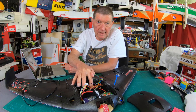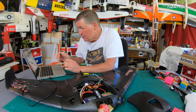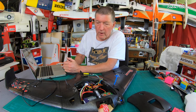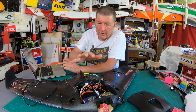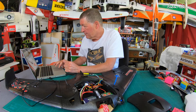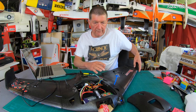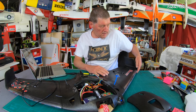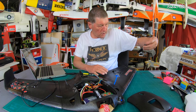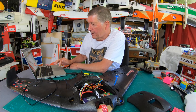You have to download the latest firmware from the Matek website because the configurator at the moment, version 2.5.1, won't give you the right firmware for the board. So you just flash it with the firmware from the Matek website. While we're connecting up - I was just about to do some HD footage on board down the coast, it would have been spectacular, but I knocked my fin off, so we only have the DVR recording unfortunately.